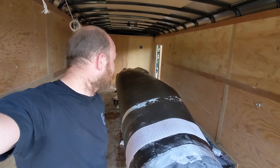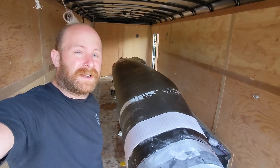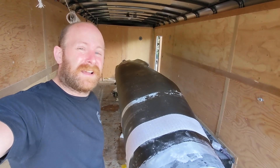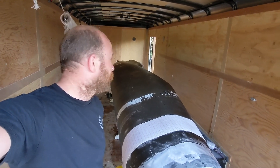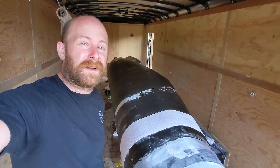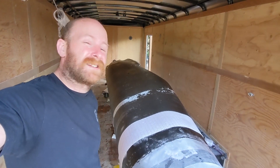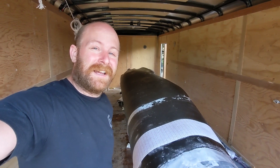Okay, just finished off the last layup — had to do everything by myself so it was a bit of a rush. I got all the layers finished: peel ply and the core mat. It took about three hours per side, so tomorrow I'll let it cure and I'll pull the peel ply off and hopefully everything looks good. It already looks like there's a couple little wrinkles but not too much, so fingers crossed.